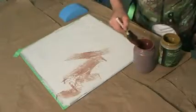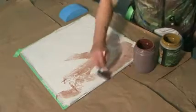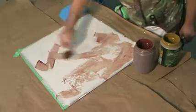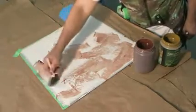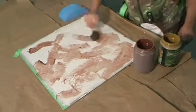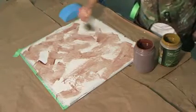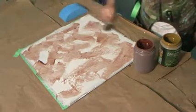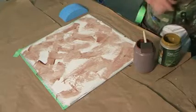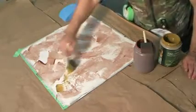Glaze is a type of paint that is translucent and remains wet for up to an hour or more. This allows you to work with the glaze by working it into the texture and creating different degrees and shading of color. It is the opacity and translucency of the glaze that renders the displacement of color seen in any true authentic distressed plaster. The glaze can be applied with a brush or roller and should be dispersed across the Versi-Plast in a random broken stroke, making sure to miss some areas.